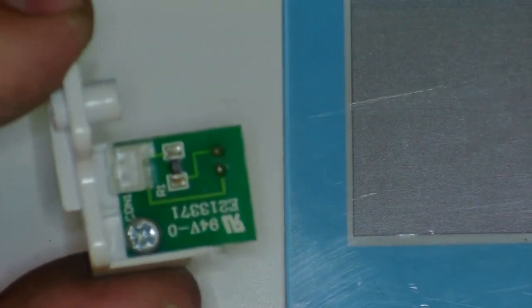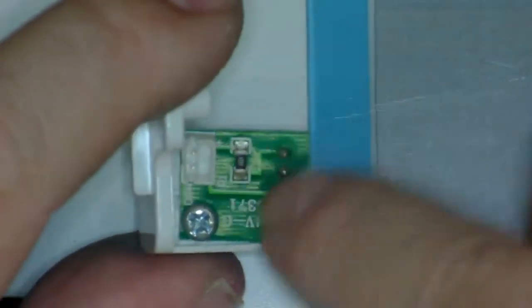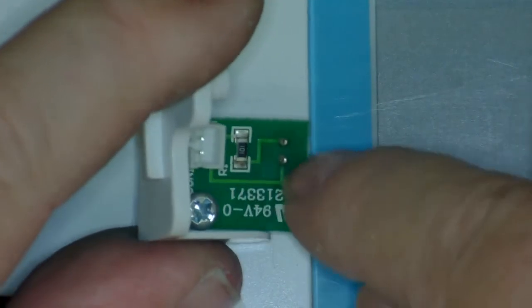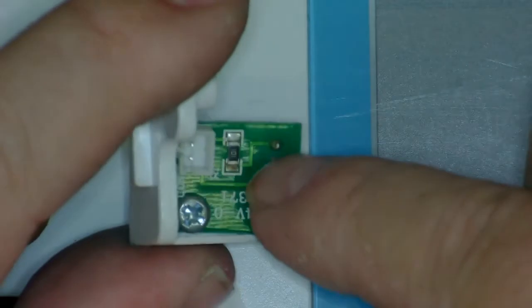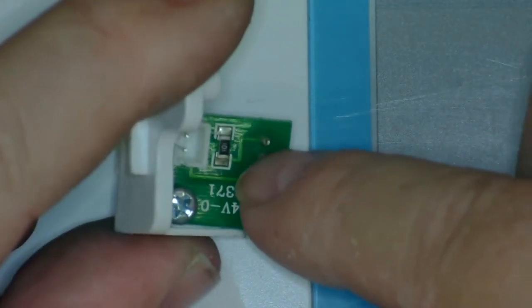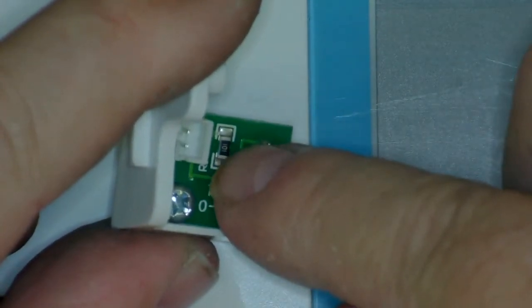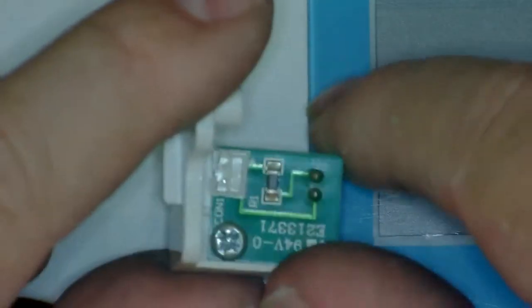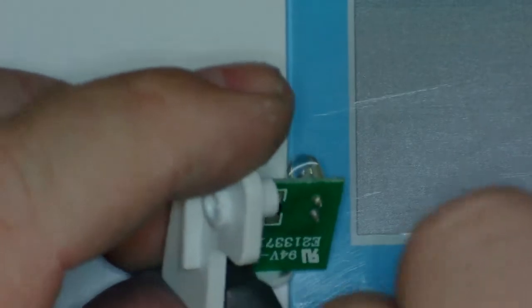Once you spin up, first of all, it's always better to do surface mount technology if you can, because once you spin up the wave reflow or the selective solder machine, whatever it is, it all costs more money. But at that point, it doesn't really matter if you're putting 2 parts or 3, right? We're wasting money by doing that single little part all by its little lonesome. And I don't even know what's going on that side. I guess let's look a little closer. Maybe we'll learn something.